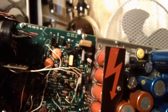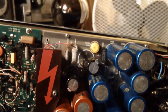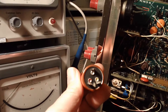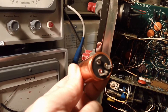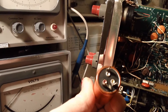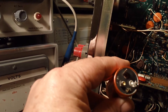The other thing that was wrong with it: I've replaced these two supply smoothing capacitors there. These were 330µF at 160 volts, made by Pi in January 1975. If you look, just in the middle of the two lower tags there's the vent hole and the electrolyte has leaked out — and there's the same with that one, you can just see it in between the two lower tags.